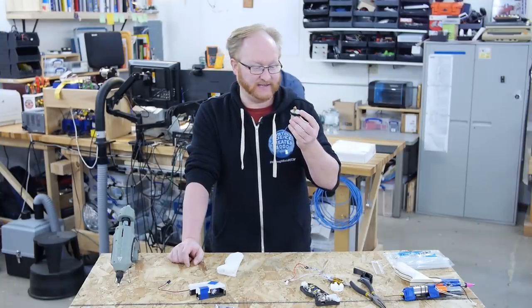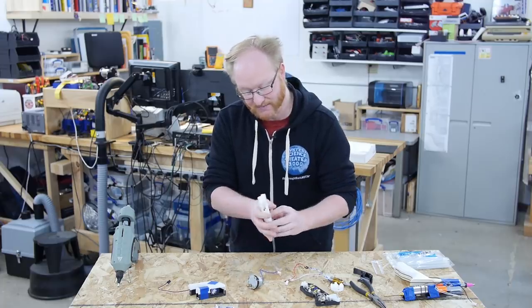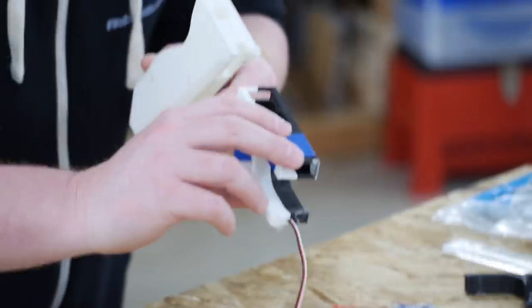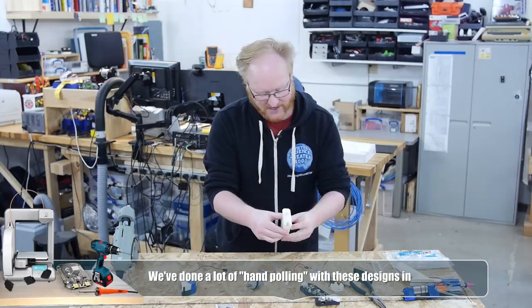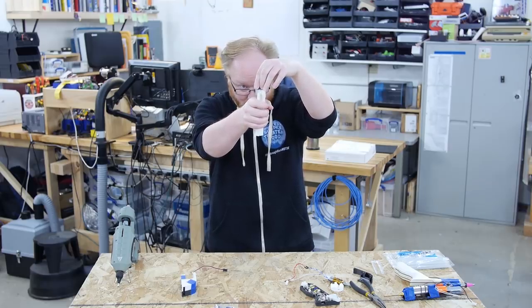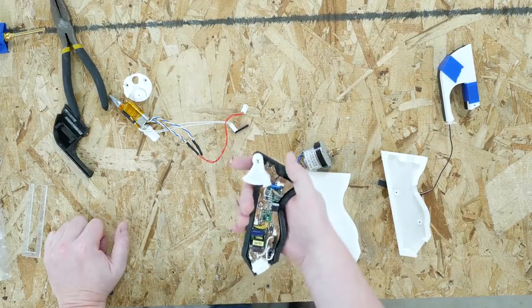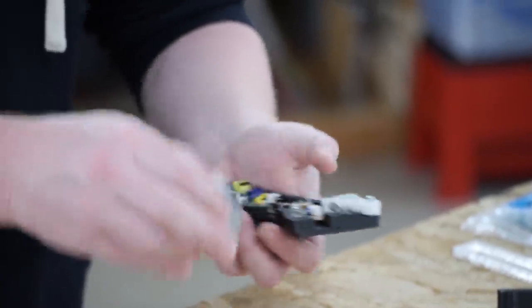We've got this motor along with a pancake gearbox. Originally we had it on the side, then Karen was talking about having it down here, which does make more sense, but the problem is it's going to fatten up the handle. We did some tests where we spread this out to match the auto stand and it's kind of hard to get your hand around - it feels really thick. I have trouble with it, and Karen, who has small hands, had a lot of trouble with it. If the motor goes back here, the stand is going to hit it before it goes all the way. It also caused a problem with the trigger - see how the trigger goes into the unit and up to a hall effect sensor? If the motor is right here, it's going to hit the trigger.